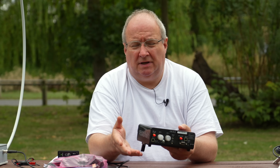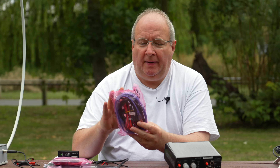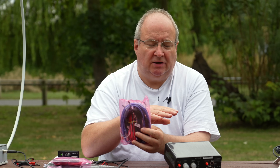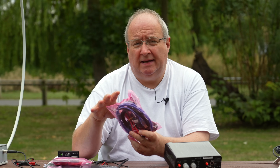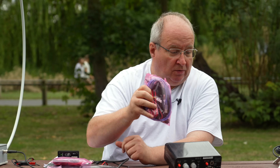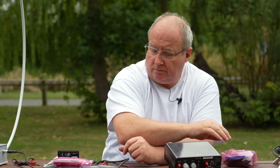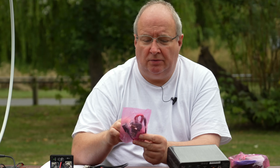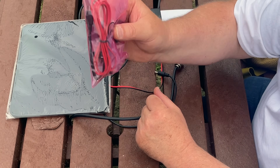On the base you've got some little plastic peg legs — it's very lightweight and portable. These are very popular for software-defined listeners taking them to a caravan, motorhome, flat, or wherever. On the side you've got all the cables you need — usually a couple of USB cables for connection to the computer, giving you CAT control plus IQ data going to the computer, where you can use the Elad's absolutely amazing software. There's also a firmware update cable, a little RS232 9-pin connector, and an audio extension cable in the accessories box. Software comes on a USB stick included in the box.